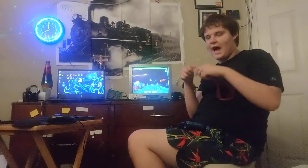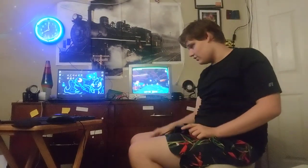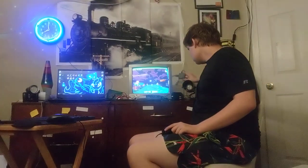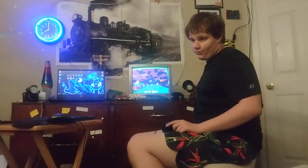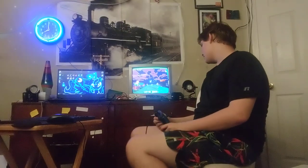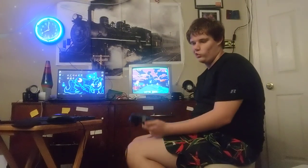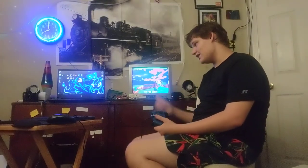The screen was going black with that thing not even able to detect a single display. There's a little line that goes high for detecting a display. That's what that converter box does. It puts out a high signal and sends it back to the digital stuff on my controller. And now I have to look at this when I'm playing Minecraft.